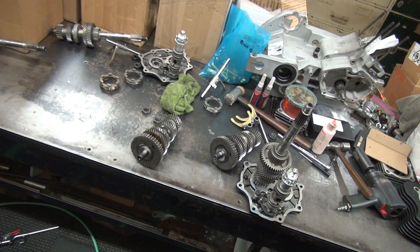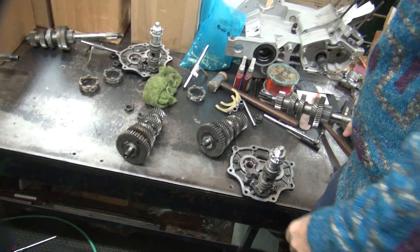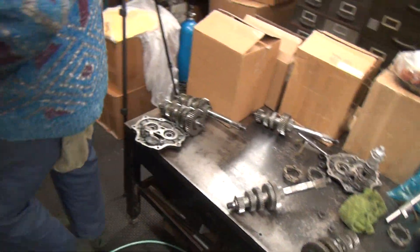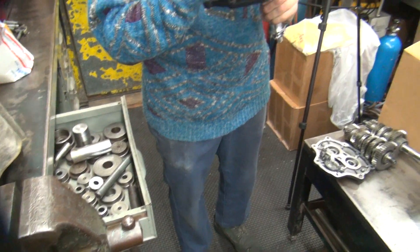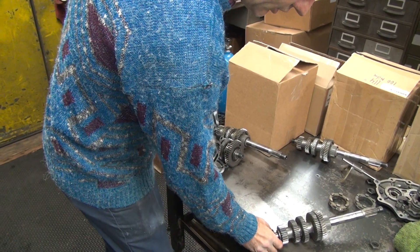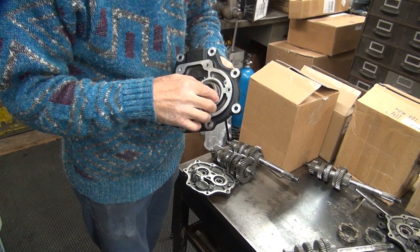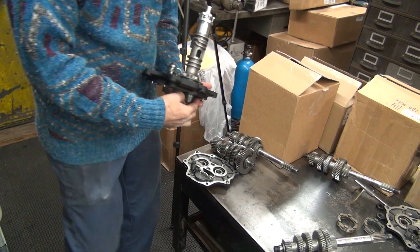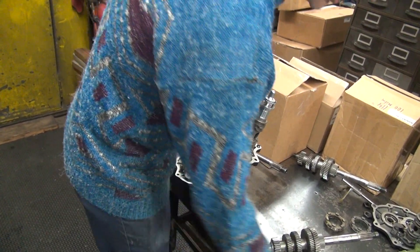Okay, now we're gonna try not to damage the bearing anymore. We need a sleeve that goes over — fits inside of there. I don't even remember what we used. Let me go over to my pressing drawer — oh yes, the good pressing drawer. That looks like something that might work. Does it ride on the inside of the bearing or the outside? On the inside, where it belongs. That'll go inside of there on both shafts — maybe use the fat side down. Go down. There you go, straight on now. I think it's deep enough; it'll clear the shaft too when it's completely on.